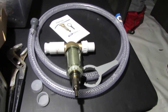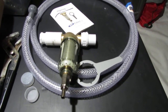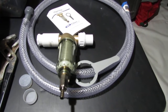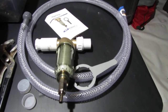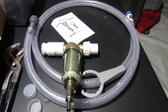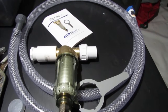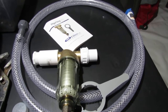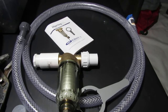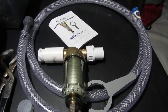I paid a little bit less than 80 bucks for this. This is one step up from just a sediment filter — it also handles scale, so if you have a tankless water heater this is really beneficial and helps eliminate some of the scale in the system. This particular filter system has one-inch connectors, which is what most of them will have, so since your home more than likely has three-quarter inch, you'll probably need to get adapters. I'm using PVC in this case, but if you have PEX in your home you can adapt to PEX as well.